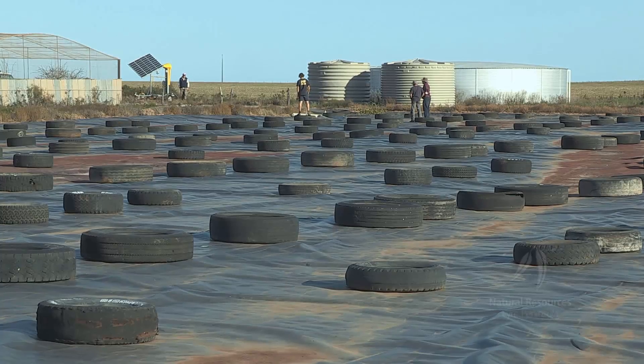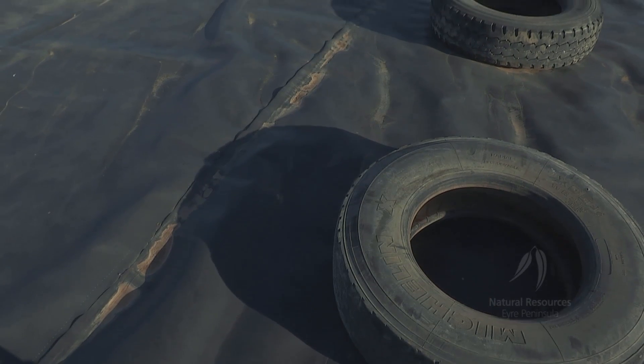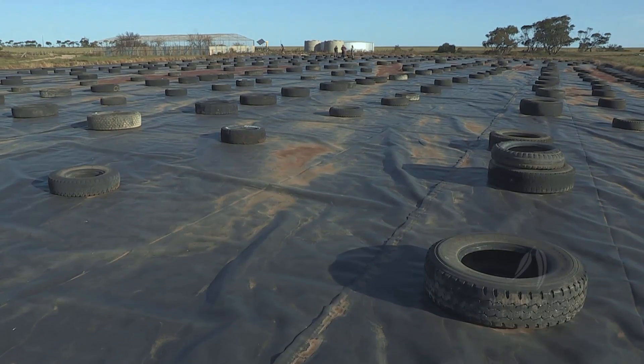We probably spent two or three days on the grating picking stones and sticks off it and making sure it was clean. This is about 100 by 50 roughly — probably lost a bit with the edges going in but we should catch about 300,000 gallons off it on 10 inches of rain.